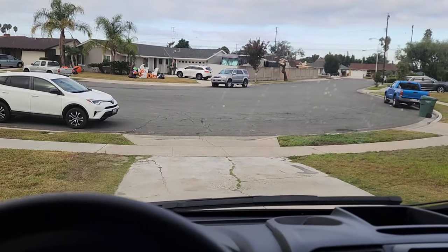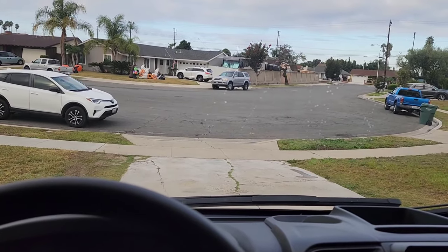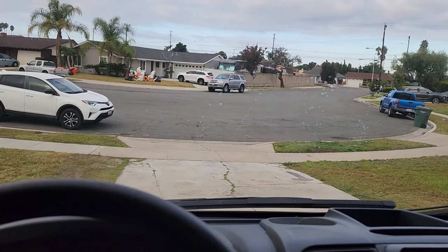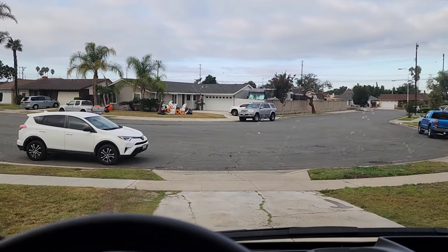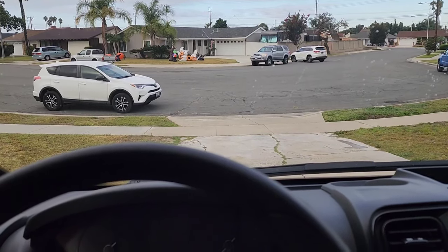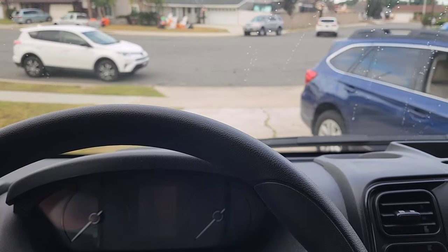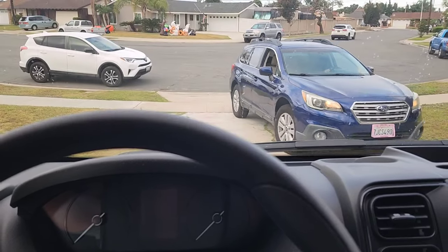Hey guys, we're at this house in Fountain Valley and they have a problem with their electrical. Number one, their outlets are really old and they're stab locks where you stab the wires in the back. And their main issue is that a microwave, when they turn it on, draws down on the lights. It's on a 15 amp.